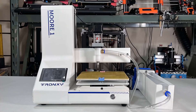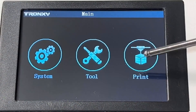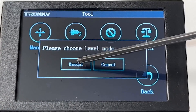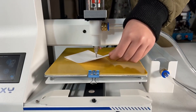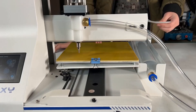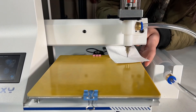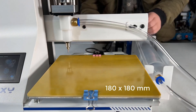Let's turn on the machine. If you have any experience with 3D printers, this kind of menu should be quite familiar. Let's do some bed leveling to make sure all the axes and limit switches are working. As there is no bed leveling sensor, we will use the paper test method to do some quick leveling. The printer can move to 5 points of the bed. The recommended distance between the bed and nozzle is 0.3 to 0.5mm. I will just use a piece of paper folded two times. Leveling a tiny bed like this is easy.